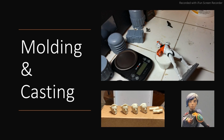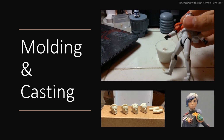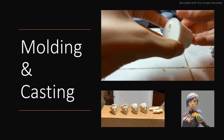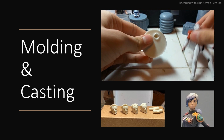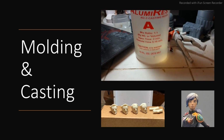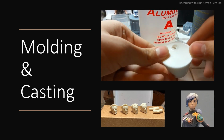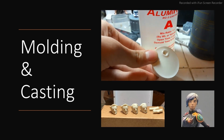And then once you have the mold completed, you're going to want to let it sit for about 4 hours while the mold cures, and then you'll be able to take it out and run it in resin. So after letting the mold sit overnight, I was able to remove his arm from the mold, and now we have a silicone little block here, and you have a negative impression of the arm. What we're going to do is take resin, an Alumilite resin, and fill the mold and let it cure. And then once it cures, you can pull out a perfect replica of the piece you're trying to cast.